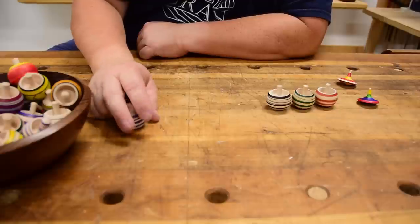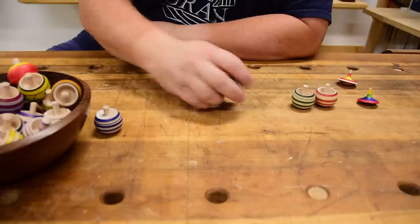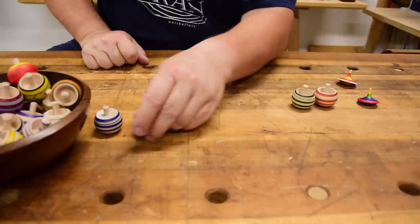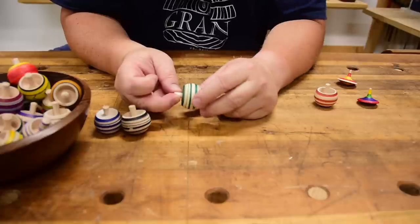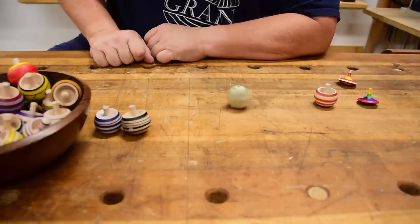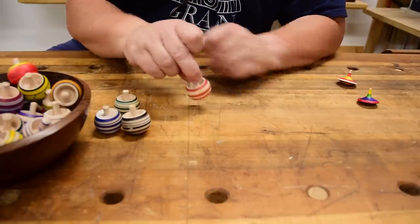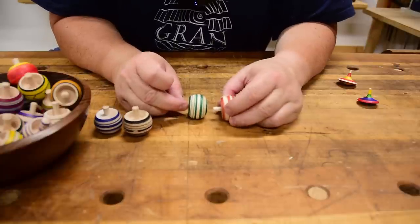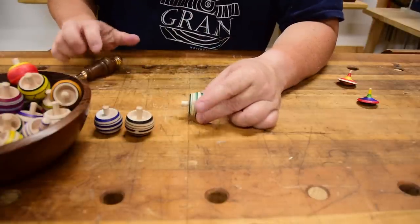This one will never flip — it'll fall over, but the handle kind of stays up and never goes all the way down. That comes down to that center of gravity. This one doesn't fall over easily so it just sits there and spins upright — it doesn't flip. The one past the halfway point flips very consistently. But the one hollowed to the base flips less consistently — it kind of depends on the spin you get. So what that tells me is that hollowing slightly past center, but maybe not all the way over, is the sweet spot.